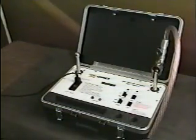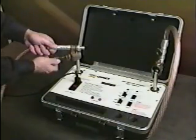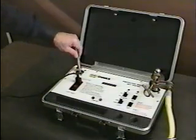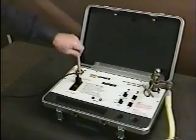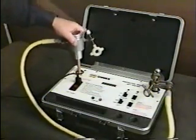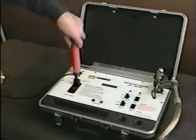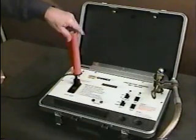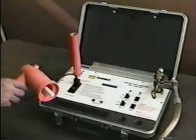The tester accommodates most types of grounding clamps, including the popular Chance ball socket clamps. They fit right on the ball stud terminals for full electrical contact, just as they do in the field. For other special grounding sets, optional terminals include a straight stud for testing certain cable sets. A special fitting simulates an elbow bushing and can be mounted in a parking stand on a pad-mounted transformer. Another option available separately is an adapter that accepts the orange-jacketed elbow on special temporary grounding sets for underground gear.